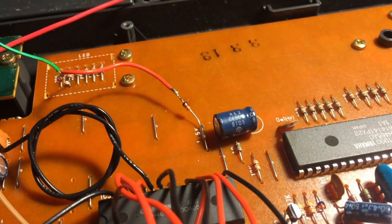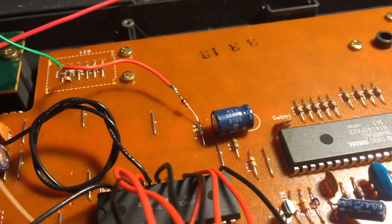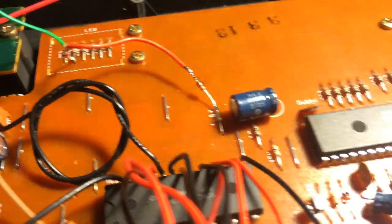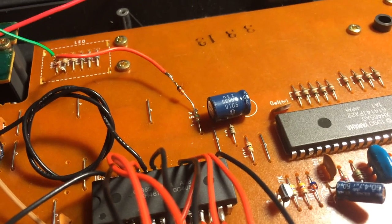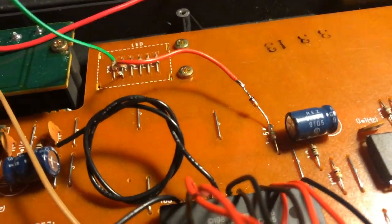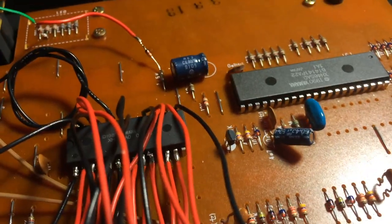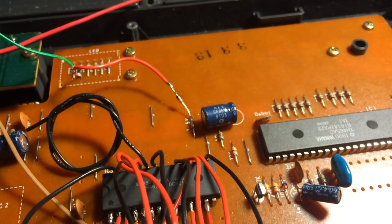I wanted a way to get a tempo out of this device, so I thought about it for a while. There's an LED on the front that blinks to the tempo of the beat. I hooked up diodes to the LED — there are two LEDs: one that starts the measure, and one for every beat in that measure. You need them both, because if you only get the beginning of the measure you miss all the other beats, and vice versa. So I combined those two signals via these little diodes. Now I can sync it with my simple step sequencer and my Korg Volcas. It's a pretty simple way to sync this DD6, and it works quite well.